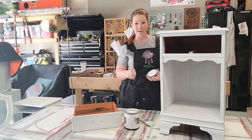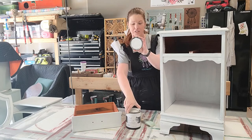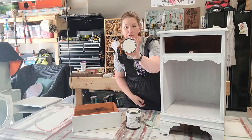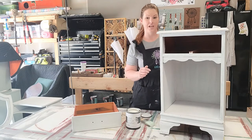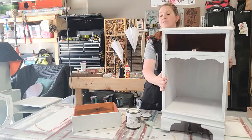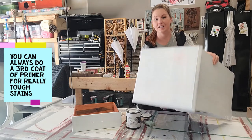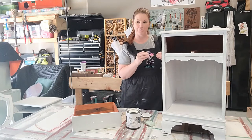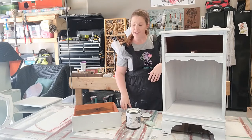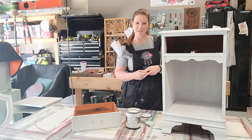I'm going to go ahead and finish my second coat of primer, and then we'll be back tomorrow to paint our piece. We've got our piece all primed and we're ready to put on our one-hour enamel in bone — it's a very very light gray color, which is why we spent so much time doing the prep work. This piece was a red stained mahogany piece and you can still see some of that pink bleed-through in those layers of primer. But I'm 100% trusting that this primer has done its job and trapped those stains, and I have no reservations moving forward with our enamel. I'll put two coats on it and then show you the results.